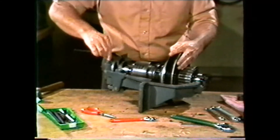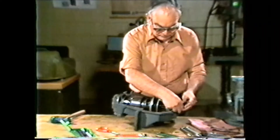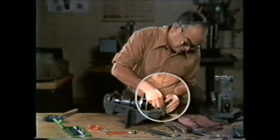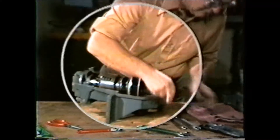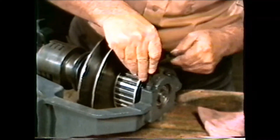When using hand tools in the shop, there are some safety precautions you have to take. Always wear safety glasses, take off your watches and jewelry, and keep your sleeves rolled above the elbows. Always use the right tool for the job.